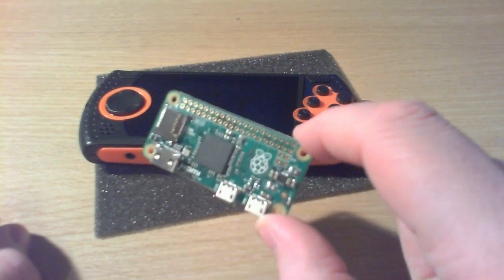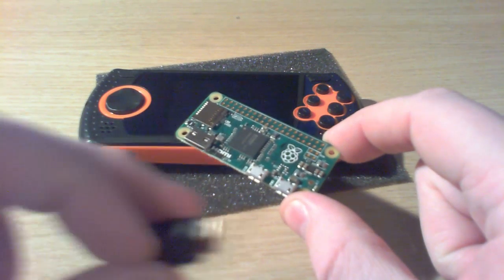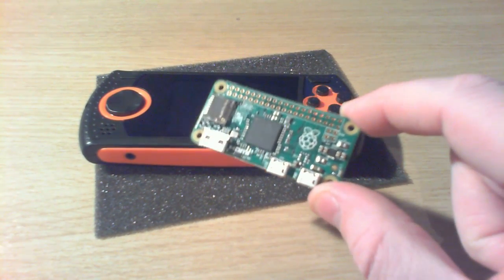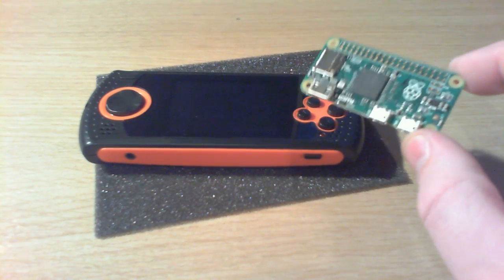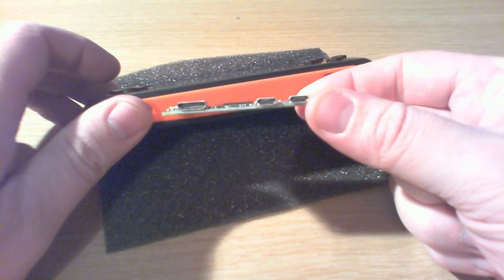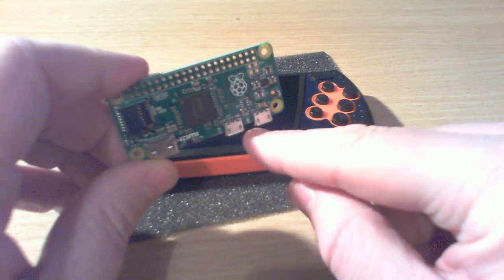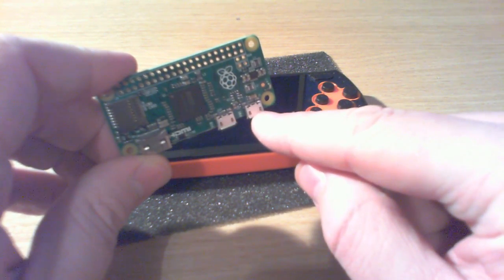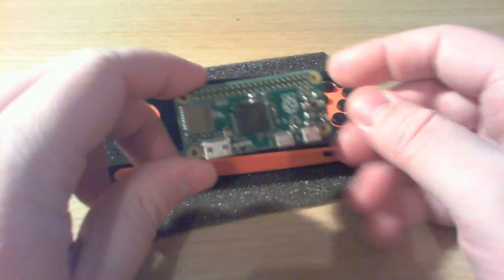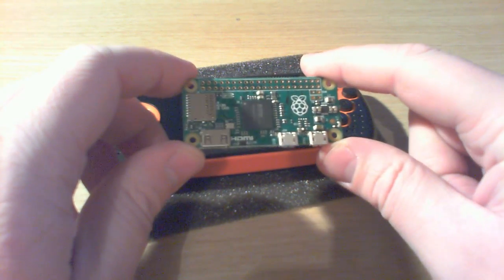This is a proper full-fledged desktop computer. You're going to need a micro USB to regular USB on-the-go adapter, a mini HDMI to regular HDMI cable, and a micro SD card for storage — but nevertheless, it's a £4 computer, and it will be more than ideal for what I need to run in here. There's going to be absolutely no concern about space whatsoever. I'm not even going to have to desolder anything — it's incredible. I probably will desolder things anyway so I can wire directly to the micro USB ports instead of using plug-in cables, just to save space.